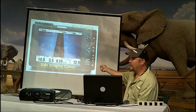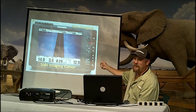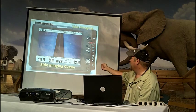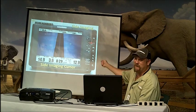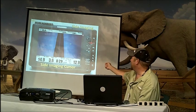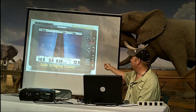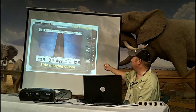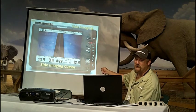The depth is going to come up if you're in the water column or you're in 2D sonar. This is the same pop-up box — same thing works here. This distance is the distance the boat is right now from that waypoint. If I continue to drive the boat forward, this number is going to get bigger. If I turn that boat around and start heading back at 134 degrees by compass heading, I can actually make that zero by driving my GPS receiver right over the top. This number changes from the current position of your boat.